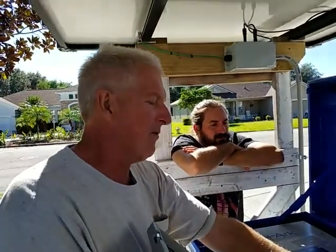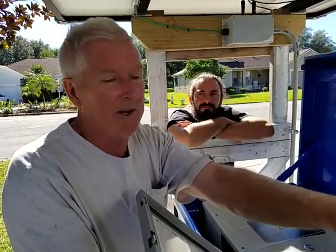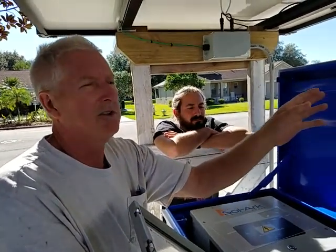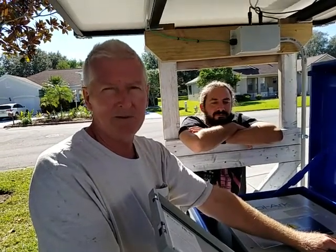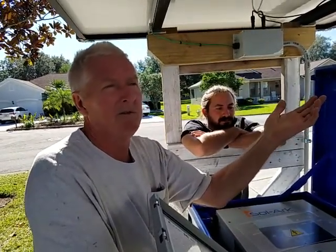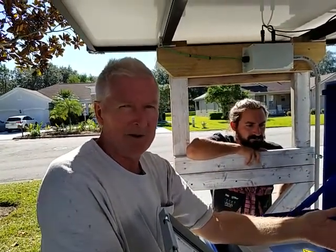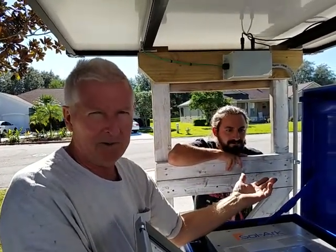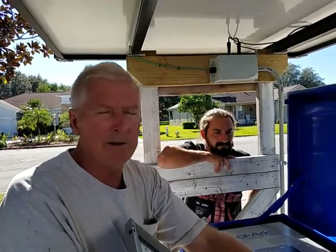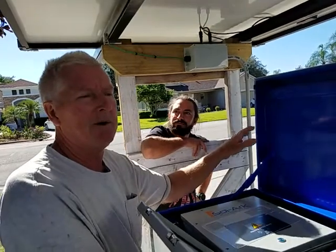And how might that work? Well, this inverter, when coupled with a battery, without any solar, without a generator, simply a grid source, could actually charge the batteries at night when electricity is inexpensive, 7 cents per kilowatt hour for a typical time of use customer. And during the day when it's 21 cents per kilowatt hour, during periods of peak demand, we would forego the use of utility power at 21 cents, and we would draw down the batteries, invert it, and offset that expense with 7-cent power, and we would repeat the cycle.